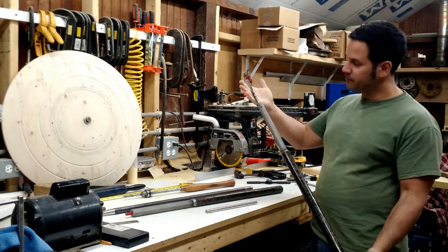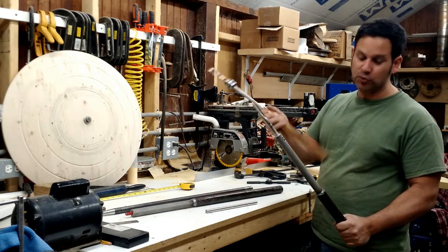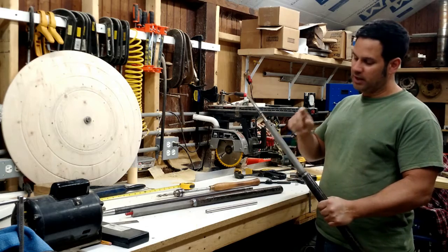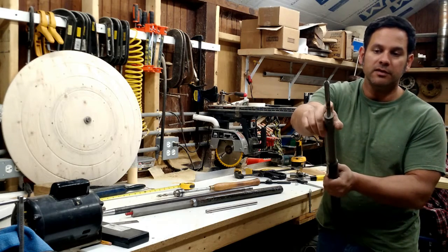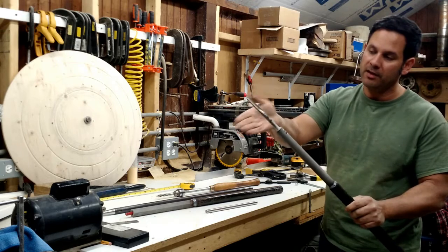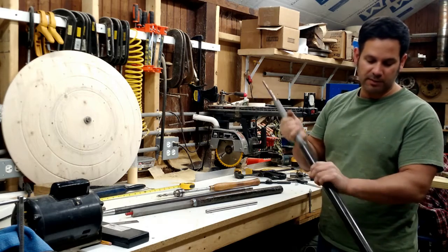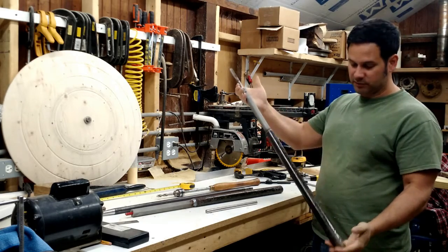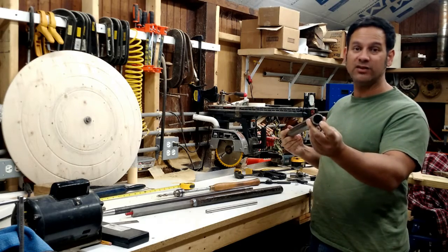This tool is 36 inches long and it is heavy — this thing weighs about 10 pounds. The spindle gouge is actually the gouge that was in this handle originally; it was too short to be useful, so I took it out and then had some use for that handle. This is a piece of one inch round bar stock, just mild steel. I drilled a half inch hole for the shank of the spindle gouge, and then drilled two holes — I really only used one, but two just in case — drilled and tapped for a set screw to hold the spindle gouge in place. The one inch rod is actually pressed into a piece of black pipe, common everyday welded seam pipe.